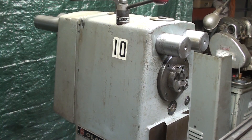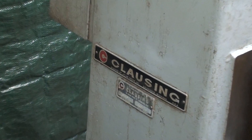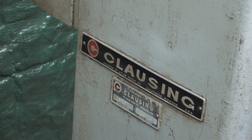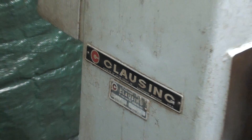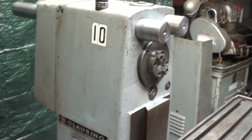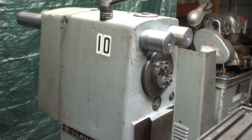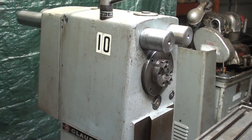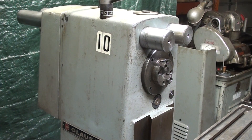Some horizontals are available with vertical attachments. To my knowledge, there is no vertical attachment for this machine. However, Clausing did make a companion machine to this, very similar, that was vertical, and I believe it had an R8 spindle — I might be wrong on that. But this is a series of machines that were very popular in schools because they were rather small and semi-affordable.